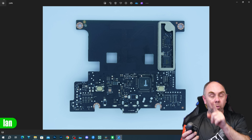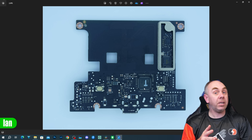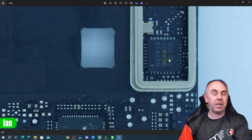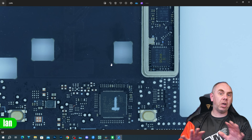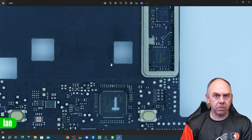The DJI Motion 3 — I haven't torn this one down yet; it's still based on the same RF chipset and will just be a smaller version of this remote controller. Really, everything we're seeing here is off-the-shelf commodity: GD32 — very cheap ARM-based chipset — and a cheap RF front-end chipset based on Bluetooth. Nothing here is custom, nothing here is expensive, and that's allowed DJI to drive the price down. So overall, that's the teardown of the DJI FPV Remote Version 3. Getting into the Motion 3 looks like it's going to be destructive; I don't really want to do that, but if I find a way, I will release a separate video — though I'm not really expecting to find much different.